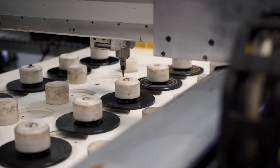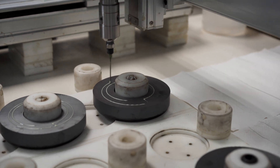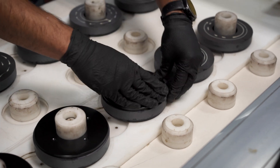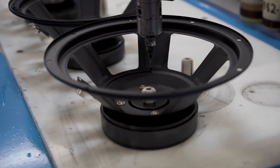One of the important parts of assembling a magnetic assembly is applying the glue properly. Speakers are basically glued together. It's odd to think about it that way, but if the glue is applied properly, it holds forever — and you have to use the proper kind of glues. We source all of our adhesives in the U.S., and we use robots to apply the adhesive so that it is exactly where it's supposed to be and in exactly the right quantities. Once the magnet assemblies are put together, we put them in a press just behind the robot, which holds them under a lot of pressure for just a few seconds. The adhesives cure and they're impervious. So that's the magnet assembly.